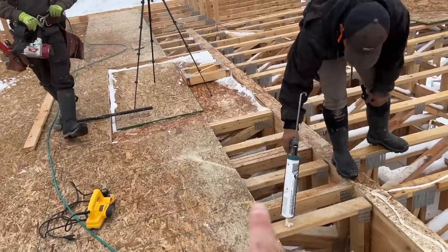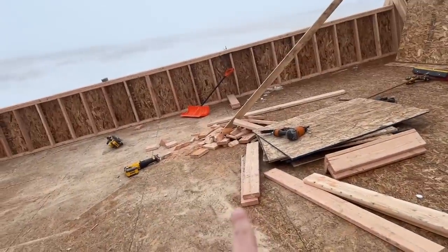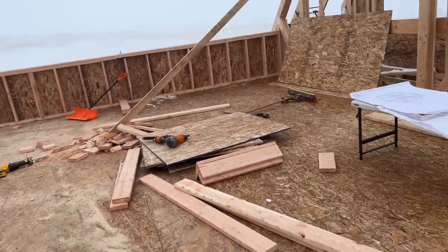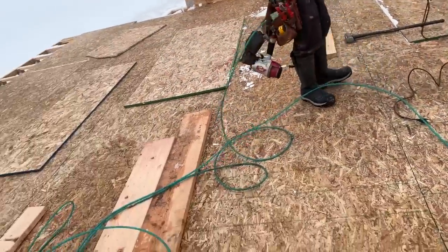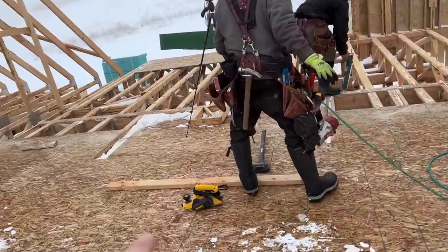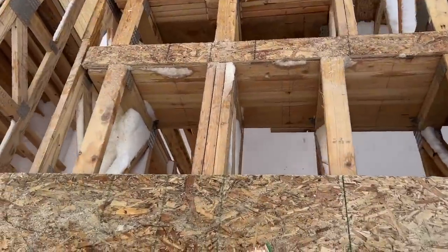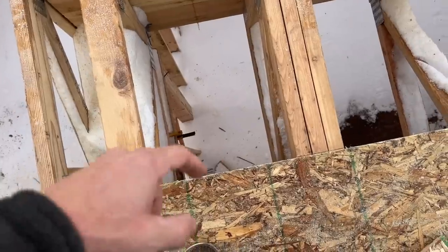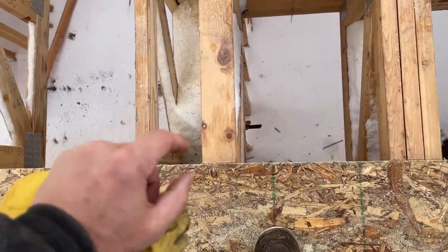So whenever you're laying flooring, you run into a problem. You pick your longest run to be your straight line, and that means you can pound into the tongue really easily. You use this blunt edge to hit because you're not gonna mar it up. But the other half of the floor, you're pounding on the tongue edge. So typically you'll just cut a line on both and then flip it around. So then you have a butt joint right there.